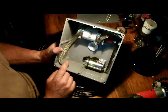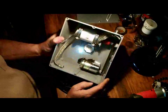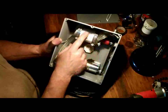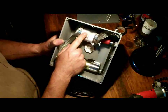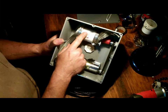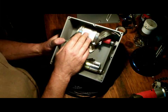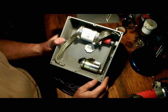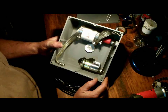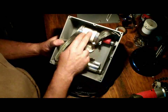The SO-239s will handle 100 watts plus. You need some way to mount the capacitor — these are not cheap; it's the most expensive part. If you're going to run power you'll need one of these vacuum variables. They're not susceptible to barometric pressure or humidity, and you get what you pay for. With an air variable cap you're often limited to around 20 to 25 watts max.